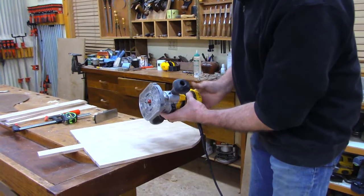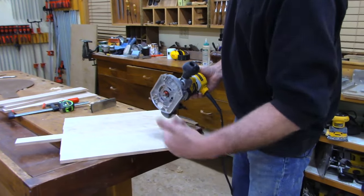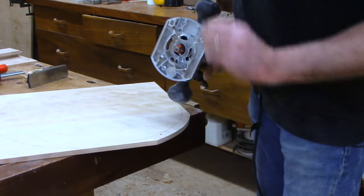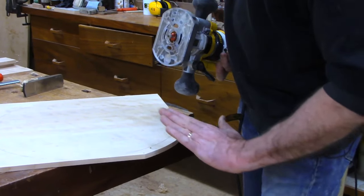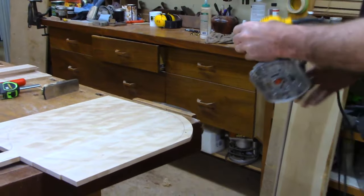But I don't even have it all the way out. So you leave a little flat in the middle, and I usually don't use the full curve of a roundover because I like to still leave an edge on the top, not one of those soft into nothing. I just feel like it looks a little classier to retain a little edge instead of it being a smear right into the surface, okay? So I just hold it like this,